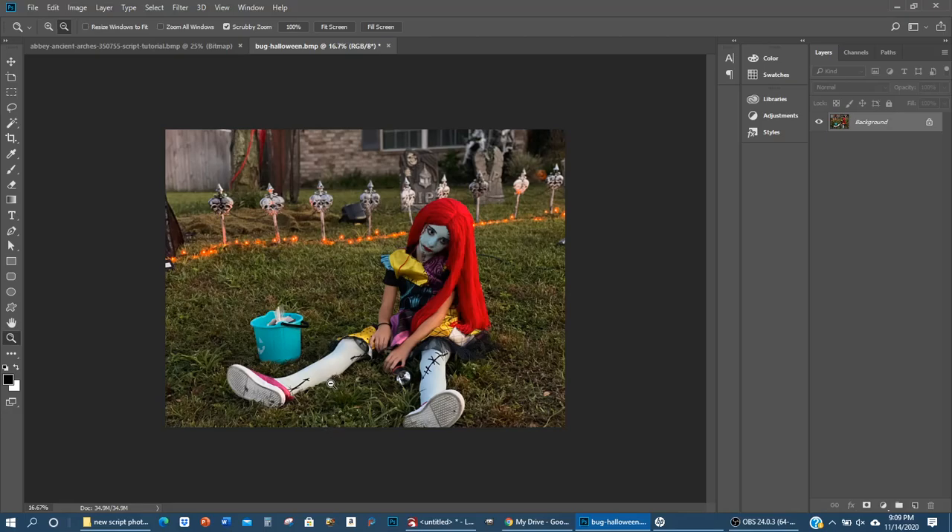You'll know maybe you can bump it five or ten percent — you'll say 'this is way off, it's got to go ten percent more.' But you've got to be patient. You can't scan two lines and say you need to change power by 15 percent — you just never know from two lines. And never ever trust your focus gauge. It doesn't get close enough for photos; you have to get that focus spot on.